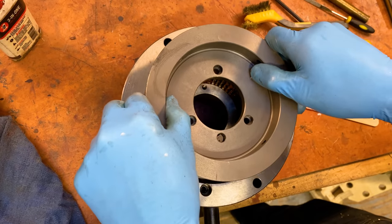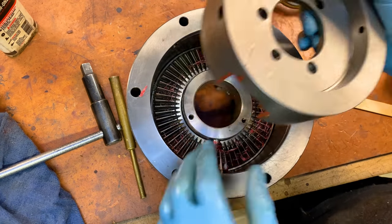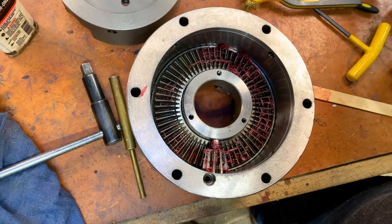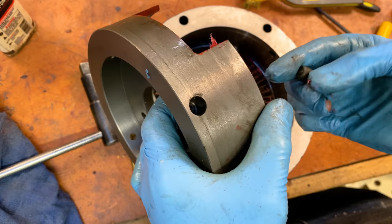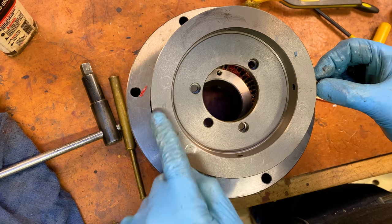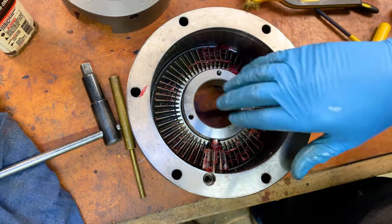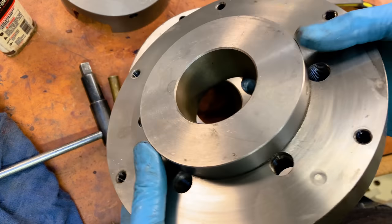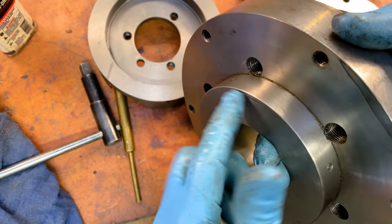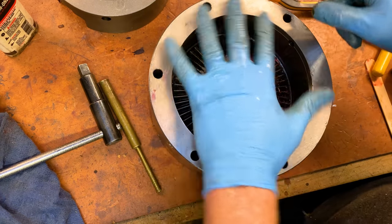This is a capture for that, and it's got three holes that line it up. This plate is super tight to this one, but it has some adjustability — and that's where these guys come in. They sit in here, one, two, three, and four. Then they are adjusted by these set screws that line up with the same holes, and when that sits on the backing plate, I can adjust how precise it is to the backing plate by adjusting these set screws.